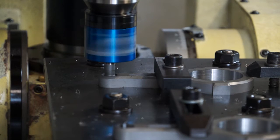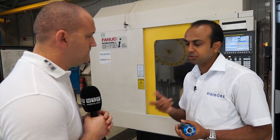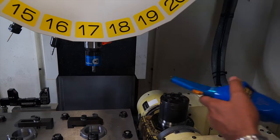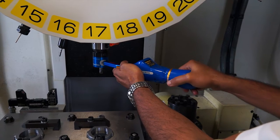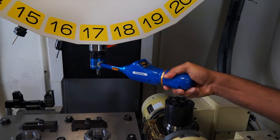Is it straightforward to make an adjustment? Absolutely. The adjustment is very simple. We have the handheld digital adjuster, and it can be done without the use of a skilled operator. Anyone can just plug it into the terminals here, rotate it clockwise for positive adjustment, anti-clockwise for negative adjustment, then remove it. No need to clamp the system again — adjustment is done, you're ready to cut. There's no need to remove the cutting tool and take it to a pre-setter; it can be done while the tool is still on the spindle.